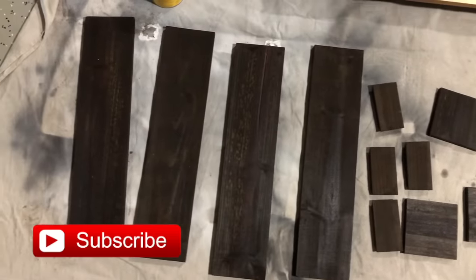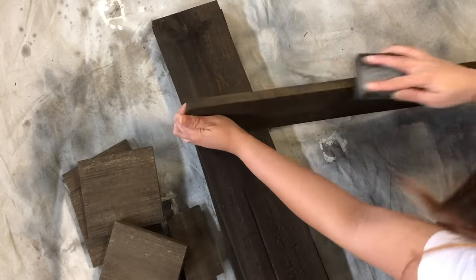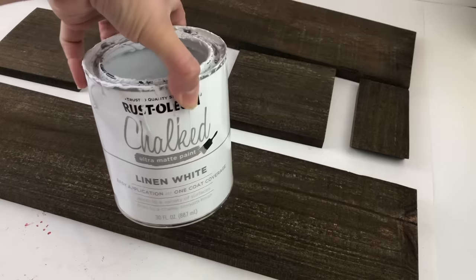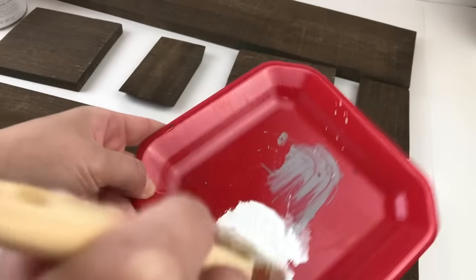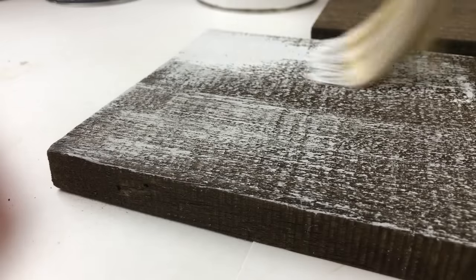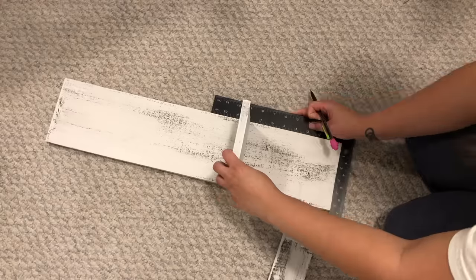Since I wanted this to look very rustic, I came in and sanded everything once everything was dry. I made two different sets and actually gave one away to my subscribers at the time. Next I took some white chalk paint, watered it down with a little bit of water, and began to brush it all over the pieces for a whitewashed effect. I'm painting these rather rustic because that was the style at the time; however, you can paint them a solid color and update them for your taste.